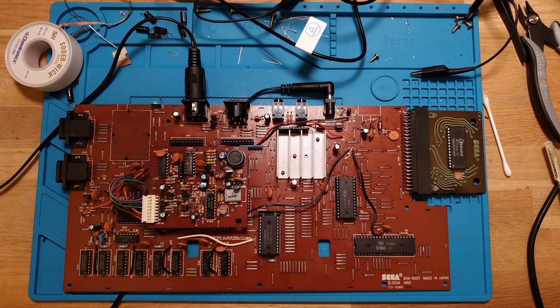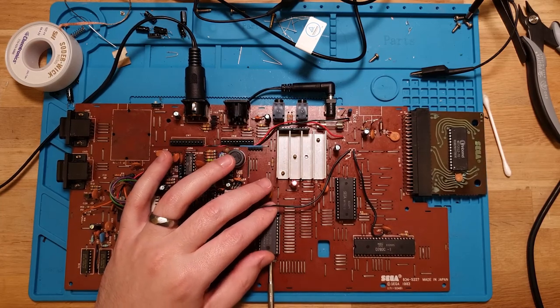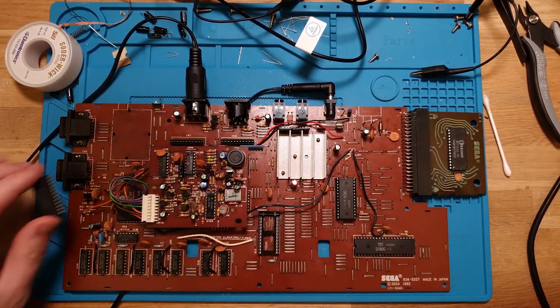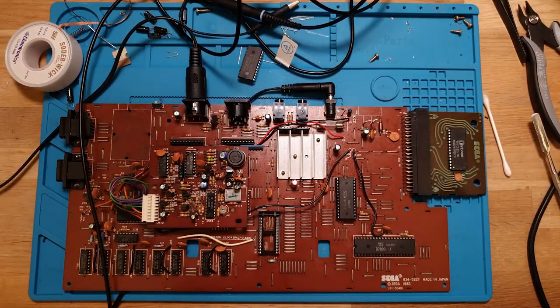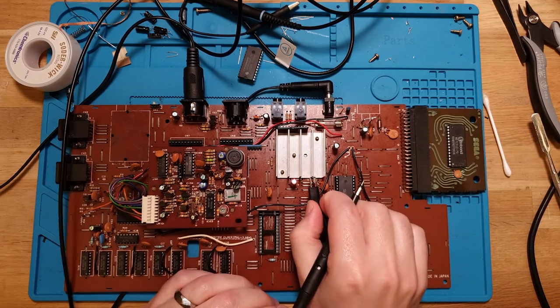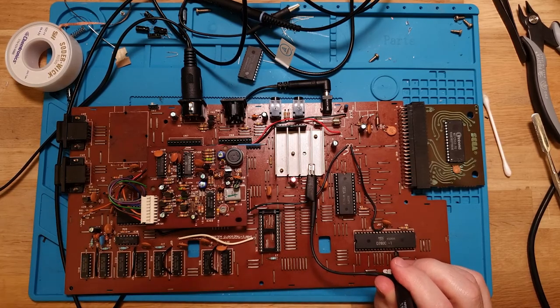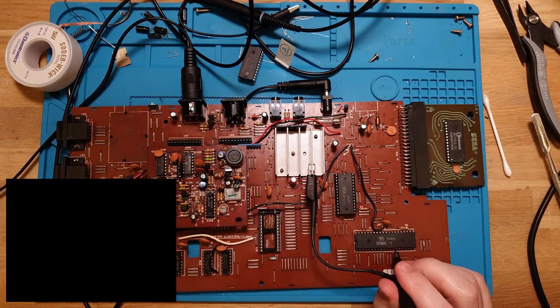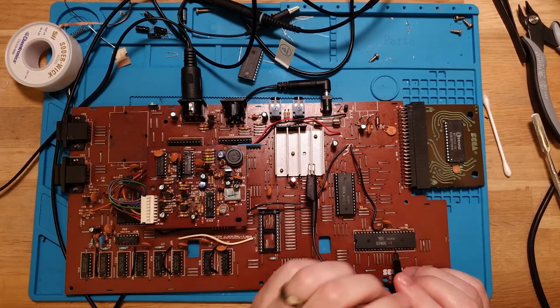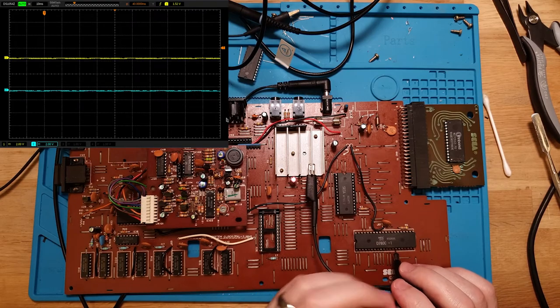Okay. What happens to that data line with the SRAM out? So let's pop that there. Let's grab our probe back out. Grab it off the heatsink again. There's our data line. So no SRAM this time, we'll see what happens. Okay, so let's turn our speakers off. It's still bouncing up to the 1.2, so let's grab a single shot again. Oops, I wasn't recording.